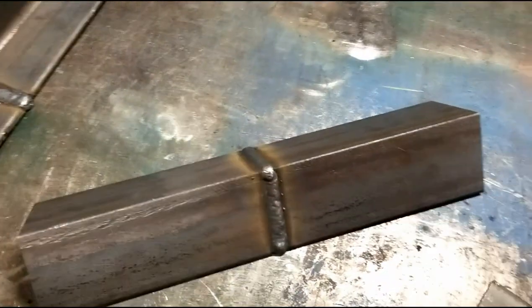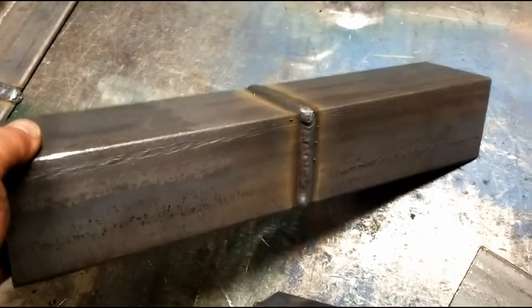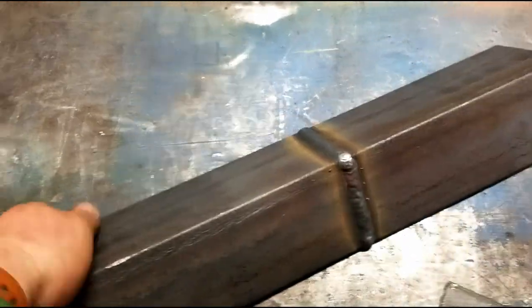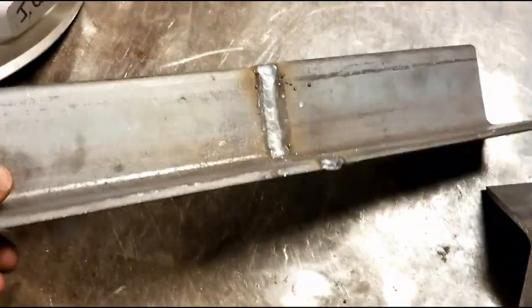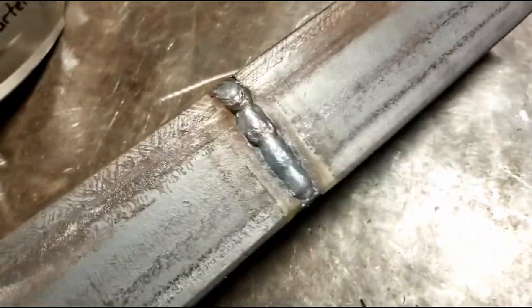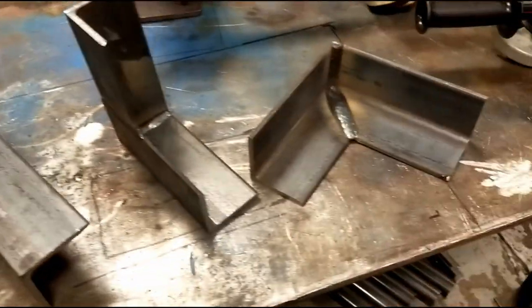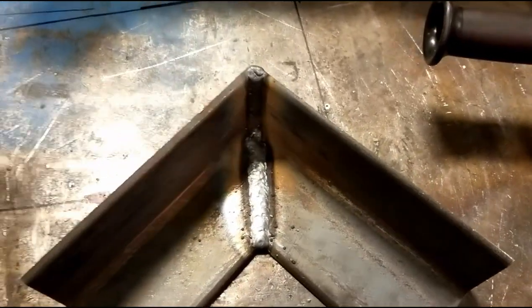What we've got here, kind of for a final view, are our regular straight angle joints. Again, these were full penetration welded. We made sure that we beveled these and/or left a root opening. This one was welded, again, with ceramic, and we have that telltale ceramic look on the outside. As I said before while we were filming, it's not super pretty, but it's way better than back gouging 40 some odd feet of side shell seam at the shipyard.